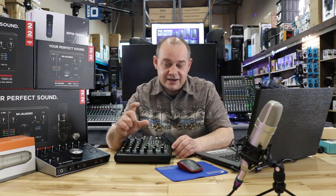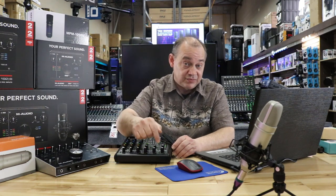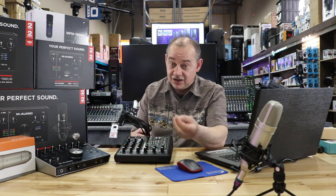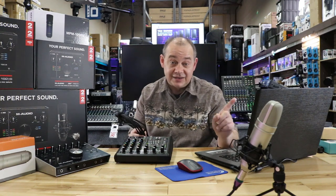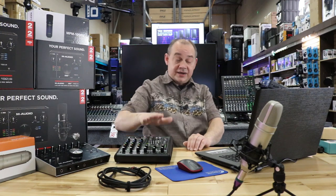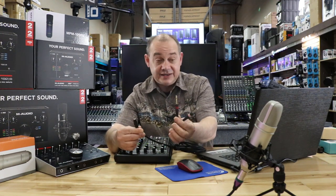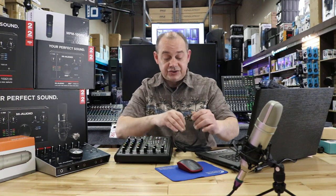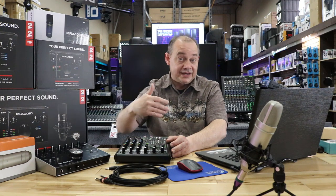You can go on Amazon and buy an external USB sound card, which costs about five to ten dollars — it'll have separate mic and line inputs. Another option is a cable that has two quarter-inch outputs at one end and USB at the other, with a little analog-to-digital converter box built in, so it plugs straight into your computer properly line-leveled. Those are available on Amazon. So if you own this mixer, you can get that USB sound card or the cable with the USB sound card built in to properly get line level into your system digitally.